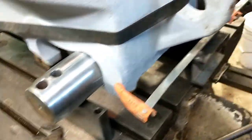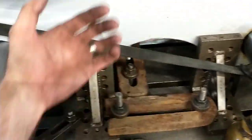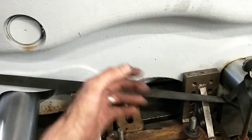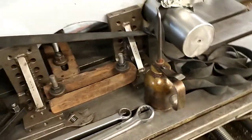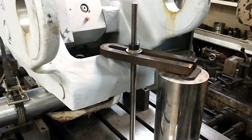Naturally, because of the way this machine wants to drop into the notch, that's the holder there, and then I am having a heck of a time getting a hold of this thing. So what I've got is I slammed 2 angle plates up tight against this side because we're going to be drilling and boring. All the load is going to be pushing it this direction. So that's just to keep it from sliding. I've got another one here with what's admittedly a light-duty clamp on it. That's mostly to help with vibration if it wants to get me going. And then, as far as downward clamping force, I'm able to get a toe clamp on it here.